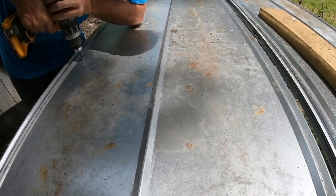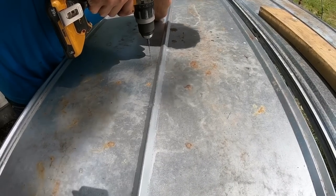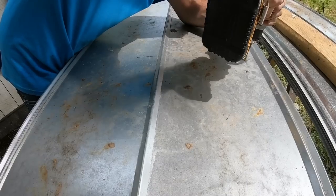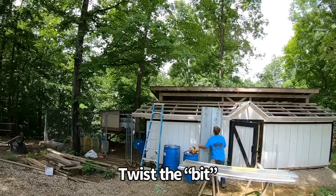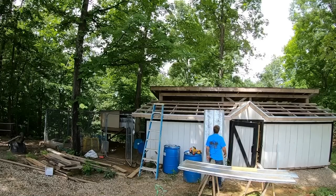It's a little bit smaller than the screw shank itself, so the screw's still cutting in the metal, but you're not sitting there fighting it, trying to get it started. You're not worrying about making sure everything's in a straight line because everything's pre-drilled together. The biggest thing, though, you will break bits doing this as it goes through 3 or 4 or 5 sheets. As it catches the 6th sheet or whatever, it'll kind of bite awkwardly and twist the screw and break it off. But aside from that, it's a pretty slick system and definitely saves a lot of trouble.